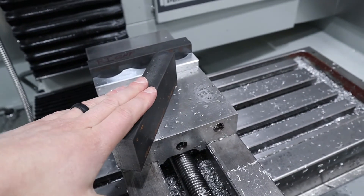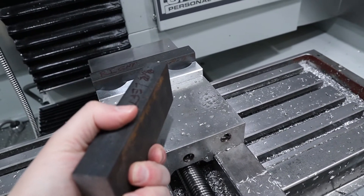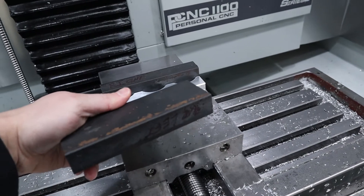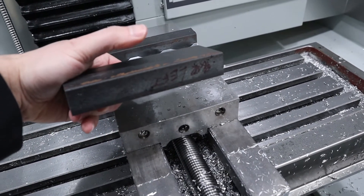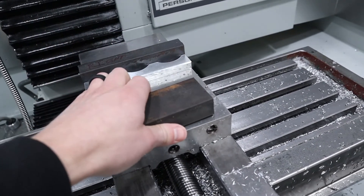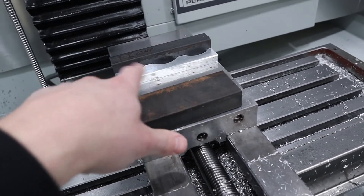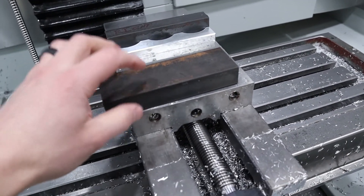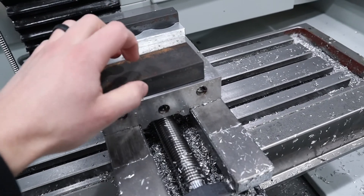I am ready to go. The machine's touched off, the material's already in the vise. First op — well, first and second op — is just going to be trimming up the top and bottom of the stock. I'm taking off about 25 thou on the top and the bottom. Then we'll face the back side that will go against the vise, flip it, face the other surface, cut the V's — it's going to be three V's — and also the holes for the bolts to mount to the vise. So there's a decent amount of tools and ops.